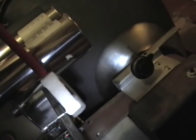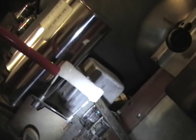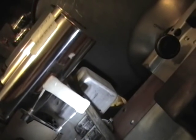It's kind of a neat compromise. The set also has one of these gizmos — I've only seen these in Philco sets before. It's a fusister, or fusible resistor. I guess this would help with current surges in the power line. If it drew too much current it would burn out, but if it was just a little bit too much current it would heat up and dissipate the power surge. I'll have to double check on that — I've never actually had to deal with one before, but it looks like it's in good shape.